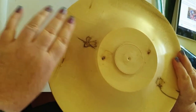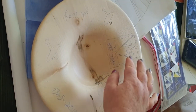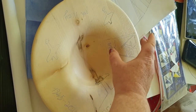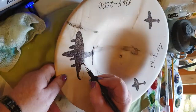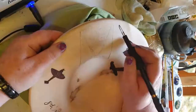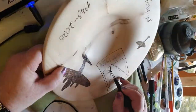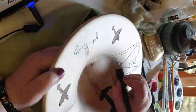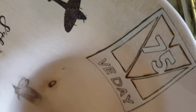He's left the tenon on at the back — that's just to help later on with finishing. And here I've transferred the design. I've used transfer paper — this is a chalky blue, it's not a wax paper. As you've seen me do calligraphy before, I've just whizzed through this bit. I've used the skew point on the actual logo, and that will mean that when I come to stain, the stains won't run so much. I'm just wiping over with a tack cloth to get rid of the transfer powder.